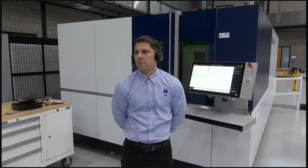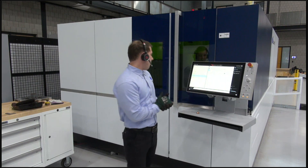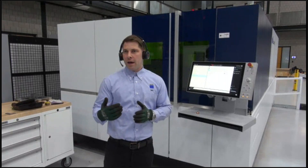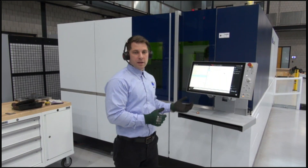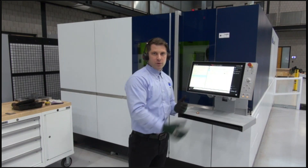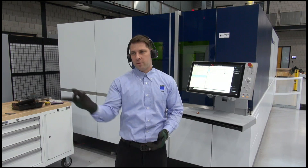We're at the end of the meeting. One last question — is there a conveyor option for this high power machine due to melting? There is a conveyor system. What's really cool is the conveyor will actually change speed depending on the direction we are cutting. If somebody slows the machine down to 80% on the potentiometer, it reduces the laser power as well so we're not burning up components shooting down through the slats. We also have the ability to turn the laser beam off if it's off the sheet for a while — another cool safety function.